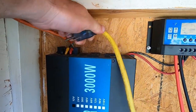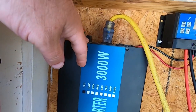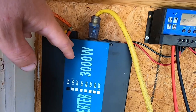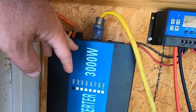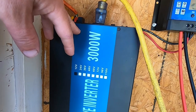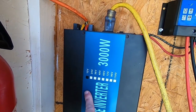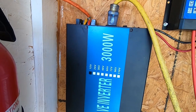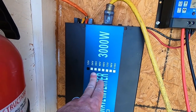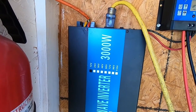This is just a regular outlet — there are two outlets in there. This runs my bench grinder. This runs all my electrical outside of the trailer — I just plug in here, turn it on, and that's what we run. This runs all of our tools: circular saws, drills, bench grinder. This is a 3,000 watt inverter with a 5,000 watt peak. This runs our air condition when we need it, our heater when we need it, and we can tie this in and run our refrigerator. But we usually run directly off our DC for our refrigerator.